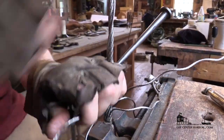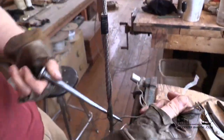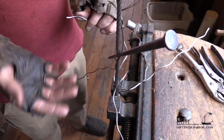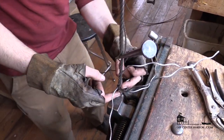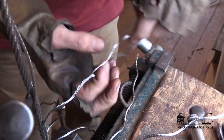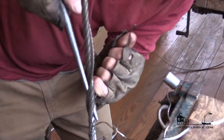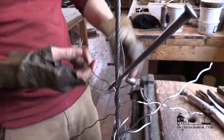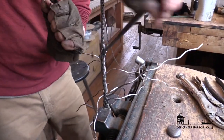This is going really nice. If you get it going in the right direction, in general it sort of stays that way. You don't want the tuck down too tight. What I do is I'll do four tucks with the first strand and then taper it, then do five, then do six and taper those. You're just trying to get a proportionally pleasing splice. There are seven wires in this strand, so I'm going to take out two, take out two, and then take out three — that's how I taper.